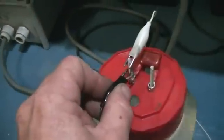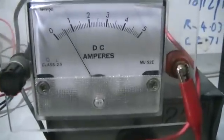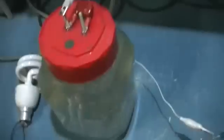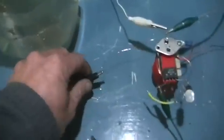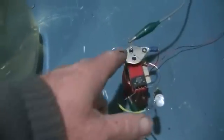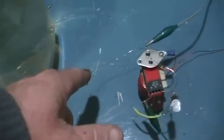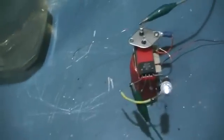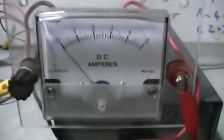We'll take it off and hook it on the other side — slightly higher pitch. We gain about 100 milliamps in draw, but the light doesn't look any brighter than it was before. We'll turn that noisy thing off. Disconnecting everything. We've disconnected the circuit from the base through the coil, out of the coil back to the emitter — zero amp draw. This is good.